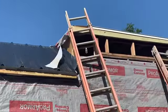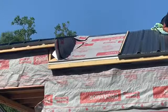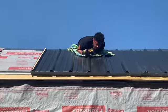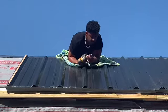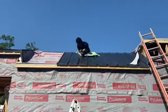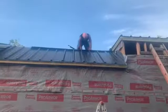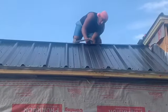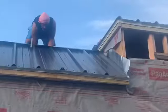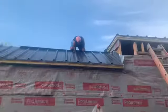So we're getting the roof on there. I got that one piece up there. Once I get that on up there I'm going to box it in, trim it in, and weatherproof it on the corners. It's so hot up here that the tin — my sweat drips don't even roll down. I got a towel up here. We tried to do it when it cooled off, but it just doesn't matter. How's it going? I'm trying to put the plastic thing in but it's so tight. So we're putting the ridge cap on right now. We got a hurricane in the Gulf — well, about to be a hurricane — so I'm trying to get this ridge cap on.